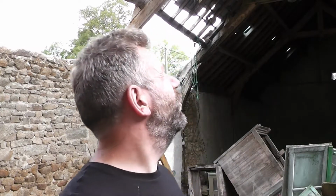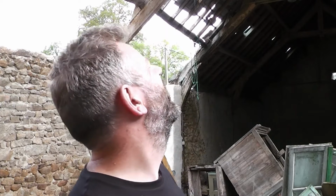We've got out a lot of the roof, but once I've done this section I'm in now, I'll be able to put a scaffold up and get the middle section of the roof out and start replacing the rotten purlins. There's about 6 of them to replace. And then as soon as that's done, we can get the rafters on and get boarded out, and at least we'll be getting watertight, which would be really good if we can get that done before the end of this year anyway. Time's in short supply at the moment, but hopefully we'll have a bit more time in a couple of months to work on it and be able to crack on.